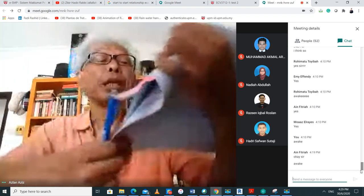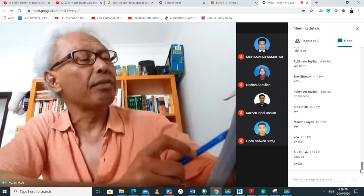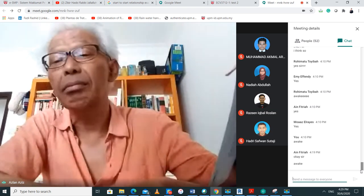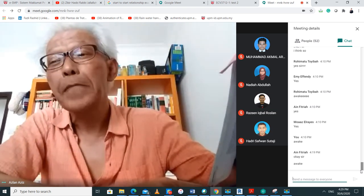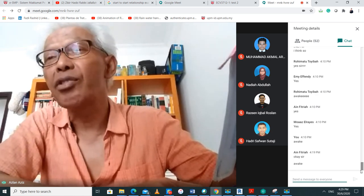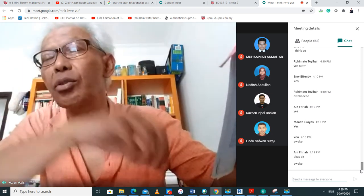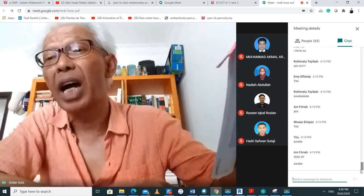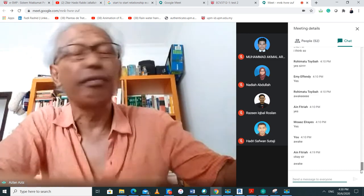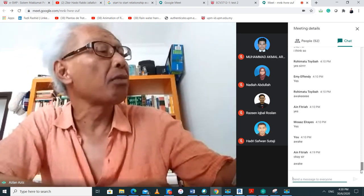All right. So at the bottom of this diagram, you see very soft, soft, medium stiff, stiff, very stiff. That should remind you of site investigation. You define the clay in relation to the undrained shear strength values that you find on site. So for example, very soft is between 0 and 250 pounds per square feet, and the horizontal axis is pounds per square feet.